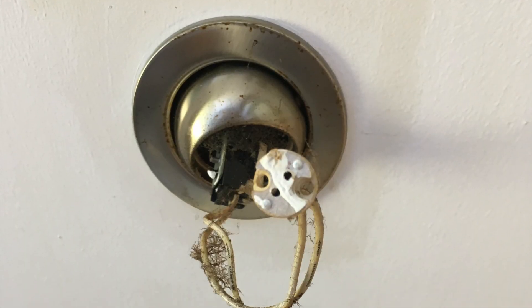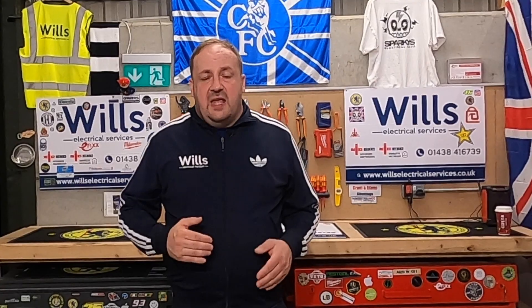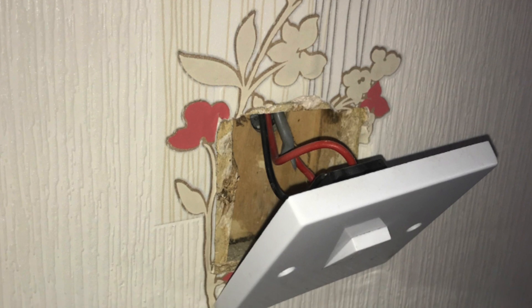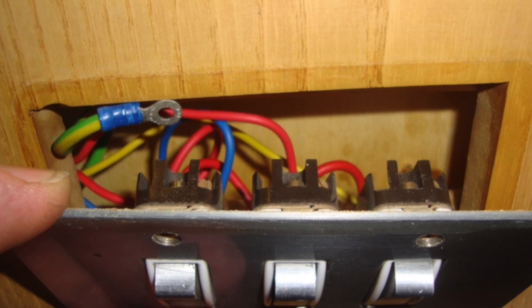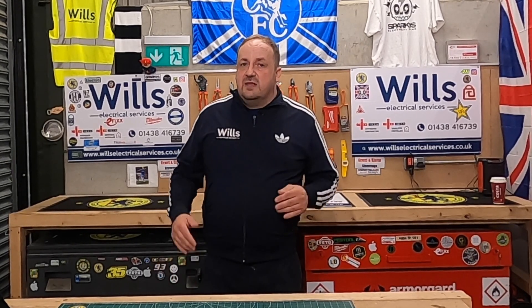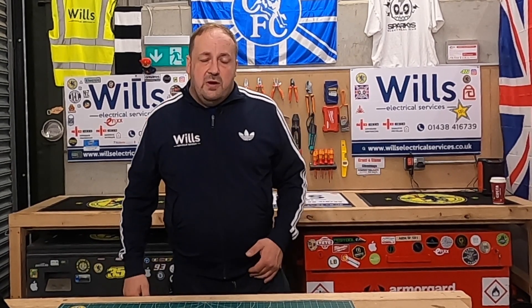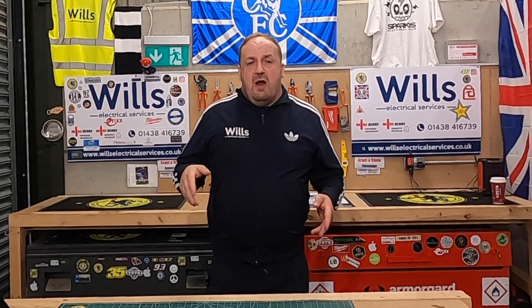For lights and switches, one of the first things I look for: I turn off the upstairs lights. Lights are normally wired top and bottom in a normal three-bedroom house. I turn off the stair light, then go look at the landing light to see if it turns on and off. If it's still on after you've turned off the upstairs lights, there's a 99% chance it's a borrowed neutral — where they've used a two-core as a strapper and linked the feed.